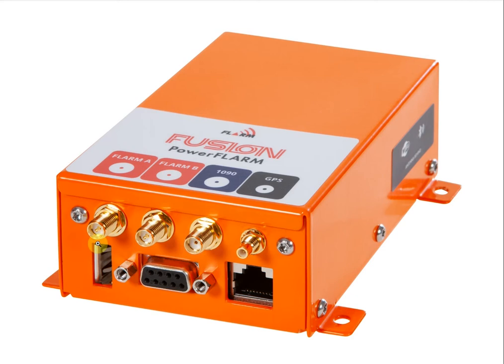There's also a USB port here that we can use to download files and upload configuration, though we'll talk about wireless configuration in a future video. There's the DB9 port — that's a power and data port. You can power the device from this port, and you can also extract the FLARM and GPS data to send to another device. The RJ port does the same as the DB9: you can provide power input and get FLARM and GPS signal out to send to another device.